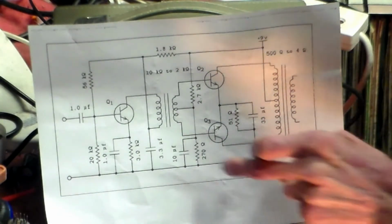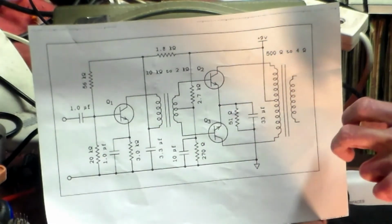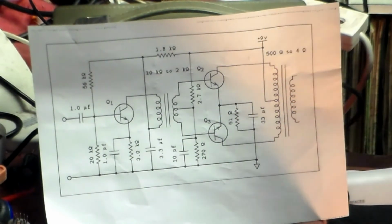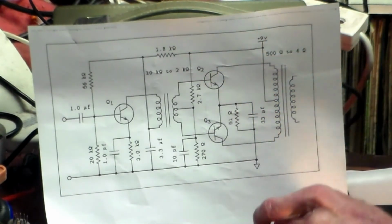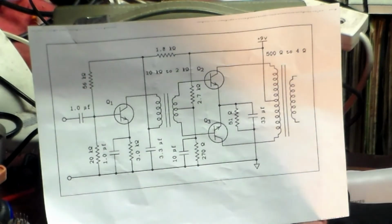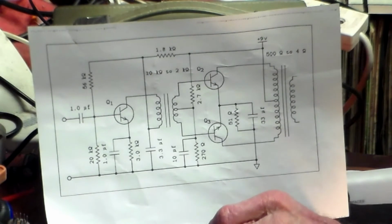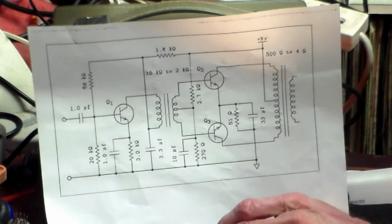The other thing, of course, that capacitor is interesting as well, that we're taking out. And also, with a set of this kind, there's also a capacitor across the battery, which was iffy as well. If that goes high in value, it will of course drain the battery quicker. So always check that as well.